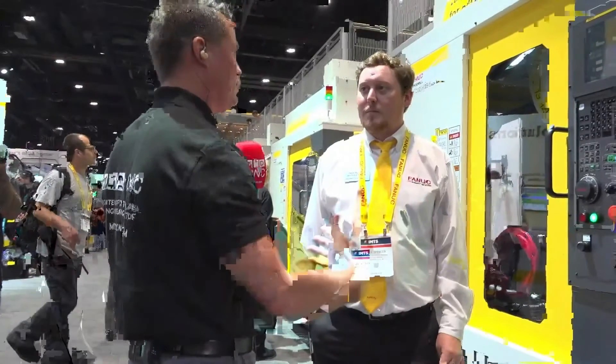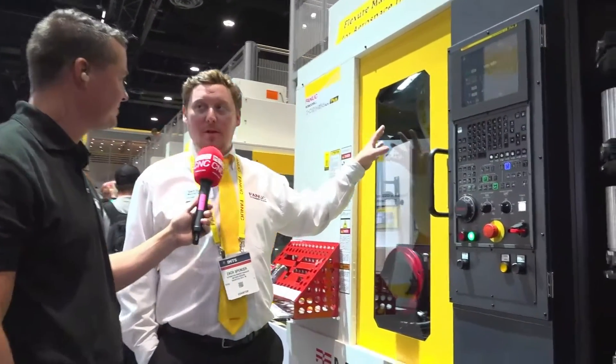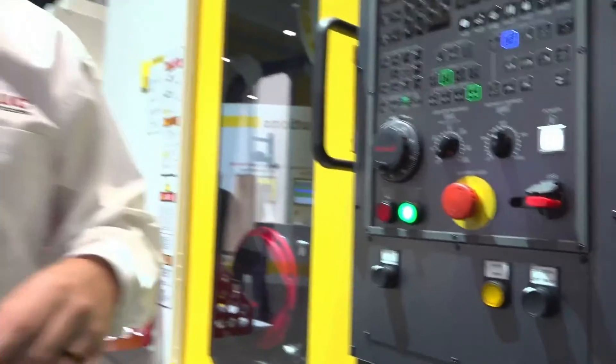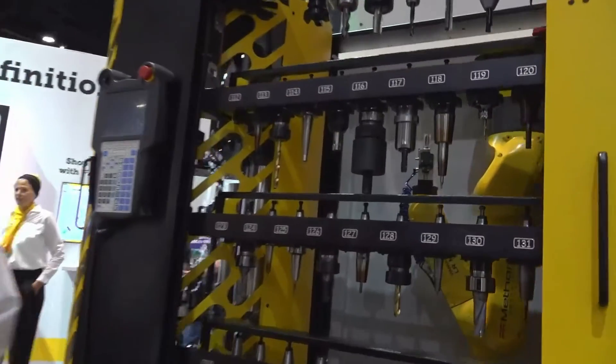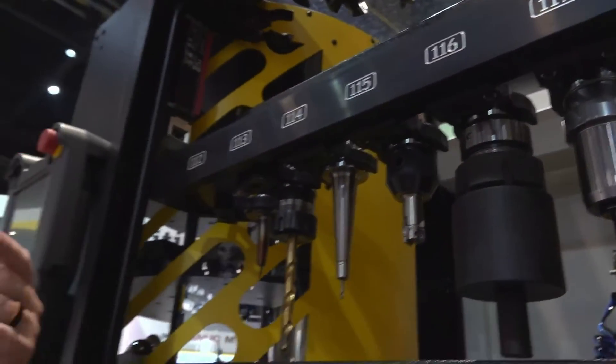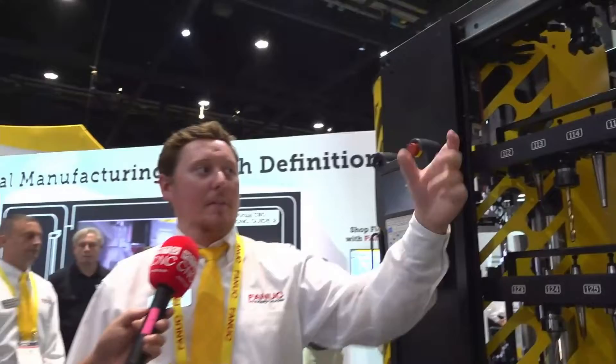What I know about a RoboDrill is that typically we have 21 tool mini pallets. How do I compensate for redundant tooling if I only have 21 tools? So this system, you're still using the 21 tools in the turret to make your parts, but the 44 additional tools on the side rack — these 44 tools are meant to allow changeover between all the various jobs filling those 60 pallets, as well as add redundancy. If you're cutting a harder material and your tool life is low, you can put redundancies out here, set up your tool life manager, and have the robot grab tools after one wears out or snaps.